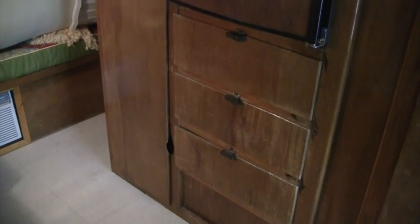These drawer fronts could use some work — there's some staining around those. Also, when we got it, there was a hole in the closet. It looks like some critter got trapped in there and eventually chewed its way out. So what I'm going to do is use some birch veneer I've bought. I'm going to take all of the doors and drawers off, take the refrigerator out, and veneer over all of this. Then finish it with the amber shellac like I've done with everything else.